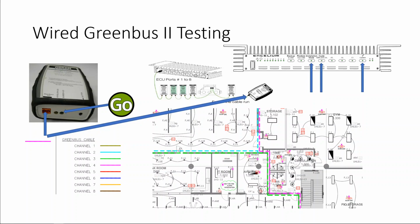It should be noted that while this ECU is in installation mode, you can go to any switch connected to any channel and press any button on the switch, and it will toggle through the same process: 100% brightness, 25% brightness, and off. Note, every switch everywhere will do the same thing. This is to ensure that fixtures that are wired for dimming will go through their dimming phases. Therefore, you can see any dimming issues before our techs go to site and correct them.